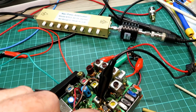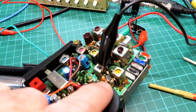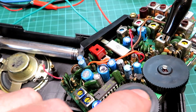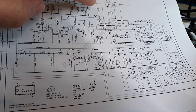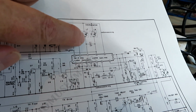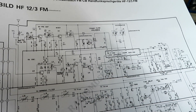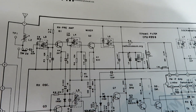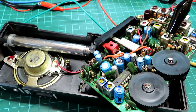It's a couple of days later and we're going to inject a very low-level signal — as low a level as we can get away with the sensitivity of this — into the radio. We've got a signal in there, a fairly low level. There's a little bit of noise on receive as well, I think it could be the supply. Based off of my diagram and the circuit diagram, I've really only stuck with three inductors to tune this: L3, L4, and L5 in the front end. We'll get it as sweet as we can.